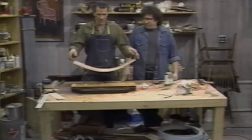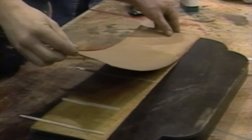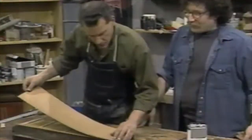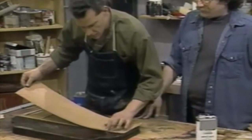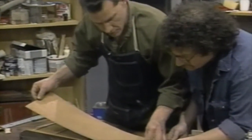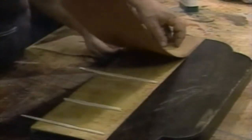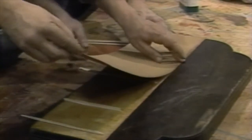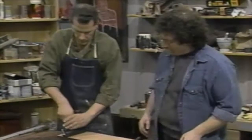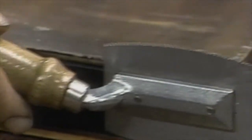Now we're going to put the veneer on — all is ready. Always with a little bend, a concavity to it. I'm going to line this up, a little over the side. I'm going to push between the stickers — that'll adhere it. Pull this out gently. Move on down the line with the rubber veneer roller, just like the old printing presses. This is a veneer saw — it's going to go flush against the piece of wood called the top, and I'll be able to saw straight across.